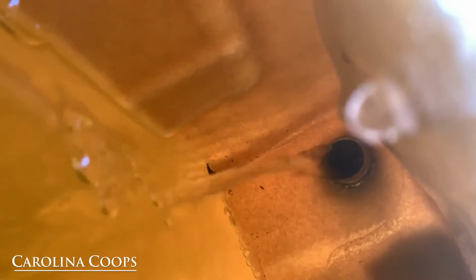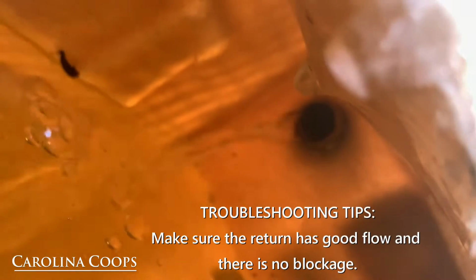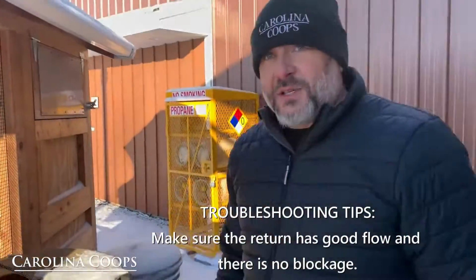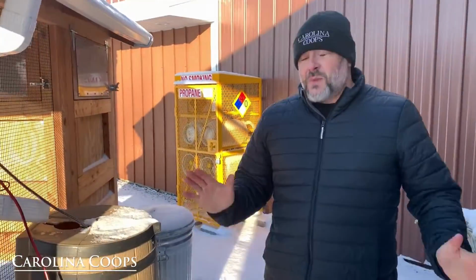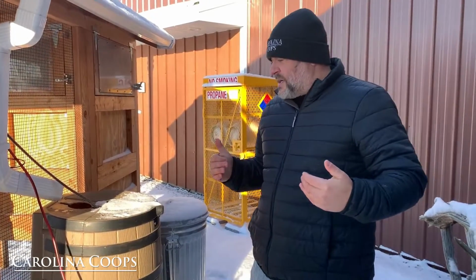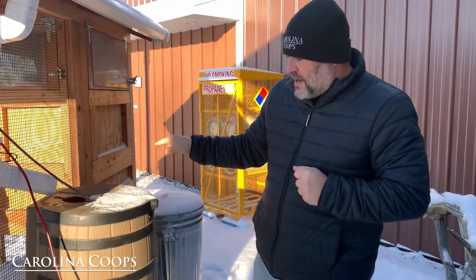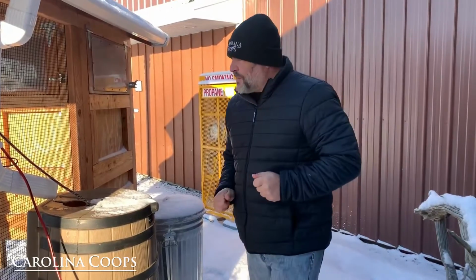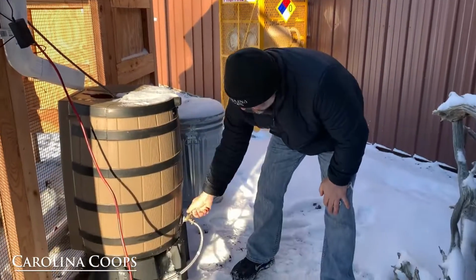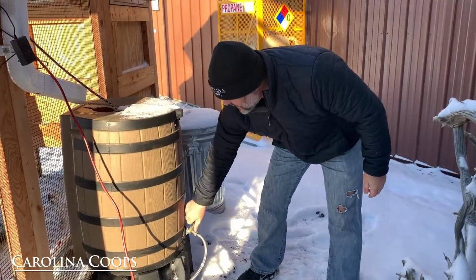Now, also, I want you guys to see the return. It's not bad. That's actually turning a little bit slower than I would like to see. I think I know why. Another reason why this system could fail is blockage, okay? People get a little confused, like, well, it's not working, and I know it's flowing. You've got to make sure. So there's a systematic approach that I highly recommend to make sure that there's no blockage. And I have a feeling I already know why that is a little bit slower than I'd like to see. So here's what I'm going to do. I'm going to turn the pump off. I'm going to close the hose bib. First, I want to make sure the hose bib's open all the way, which I think I did earlier when I first started the video. I'm going to close that.